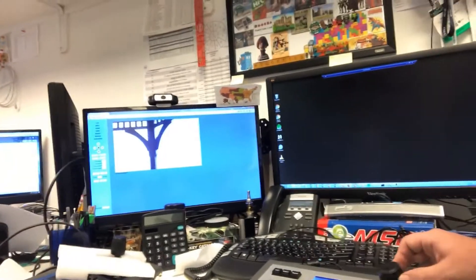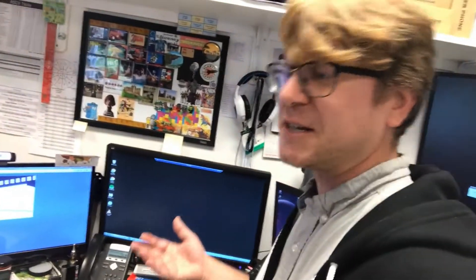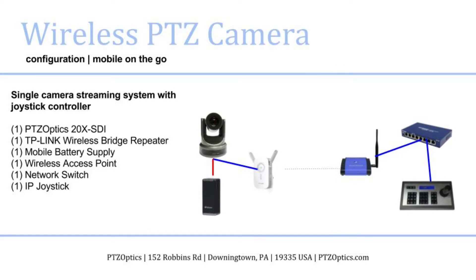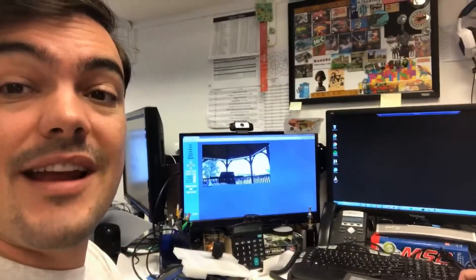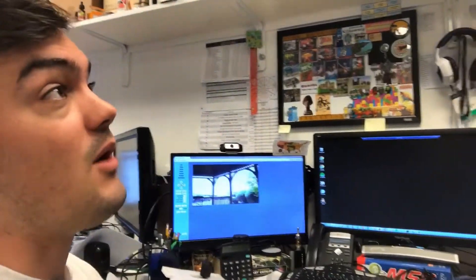How long do you think this battery lasts, Matt? Now these are engineering calculations — it should be about 7 hours. Not taking into account the fact we're using an inverter and PoE injectors that aren't as efficient, but I'm hoping at least 5 hours of use out of this battery. So to explain: we've got a network in our building with a wireless access point, and that access point is connected to a bridge outside. The bridge is connected to a wireless battery which is also powering the camera.